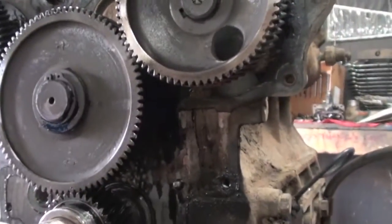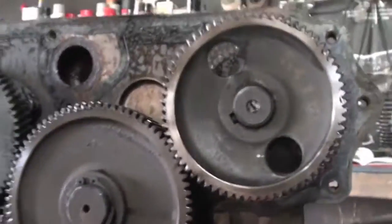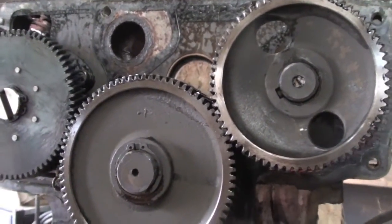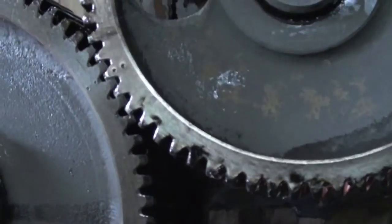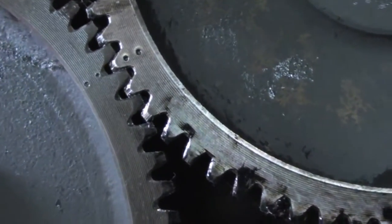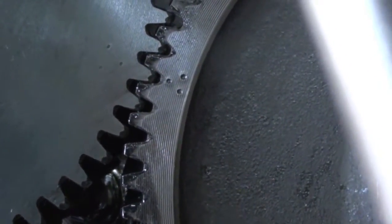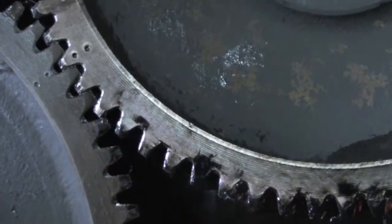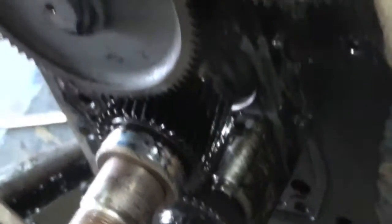So what's the deal? When I put this back together, am I supposed to line those up or leave them where they are now? I'm a little confused. But I figured it out — you just have to turn the motor over a few more times until the corresponding hash marks all line up. And they do. There's the three there, there's the two there, and the one on the bottom is going to line up with the one below it. Once I take the oil slinger off I'll be able to see, but that's figured out.